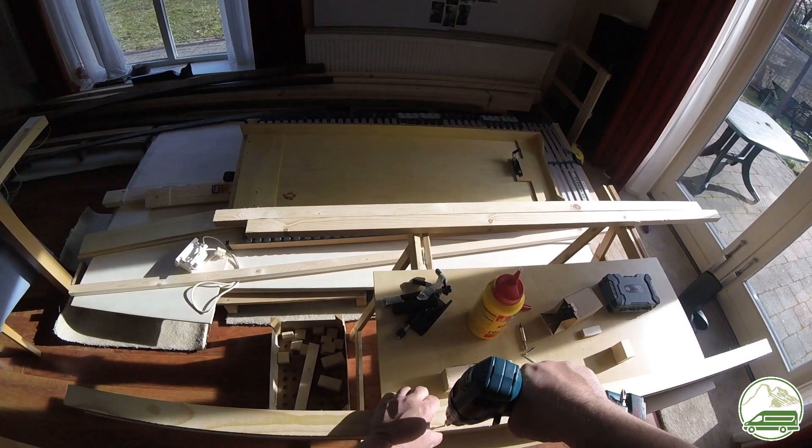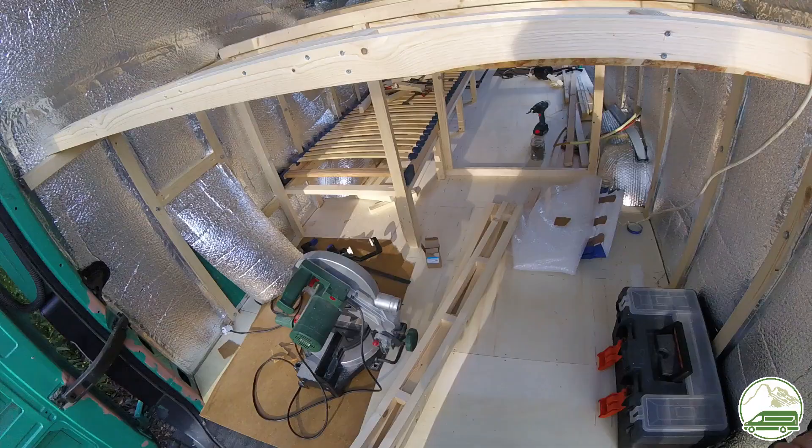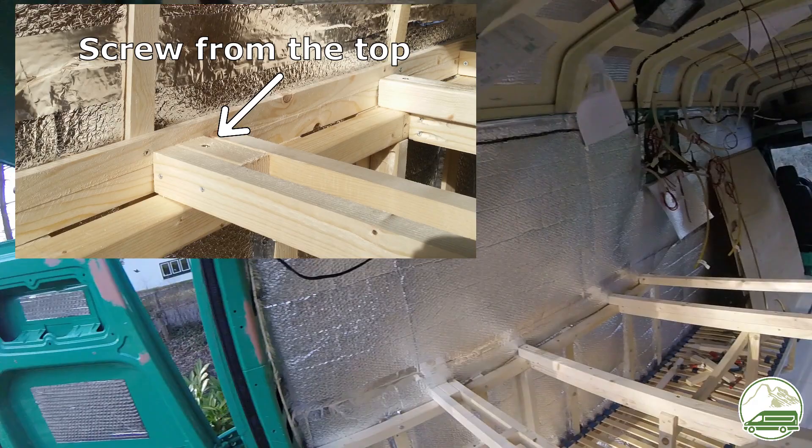This should be more than sufficient. For the remaining sections of the bed we made double cross beams with leftover pieces in the middle to give them more strength. On both ends of these cross beams we put leftover pieces of the battens that have a large surface to secure the cross beams to the beams along the walls — making it possible to secure the cross beams with large screws working from above.